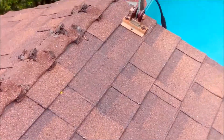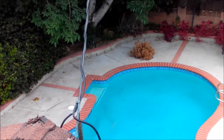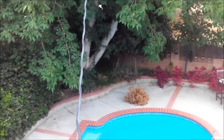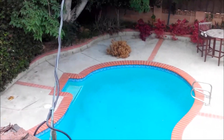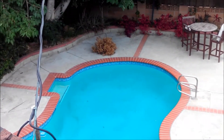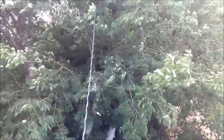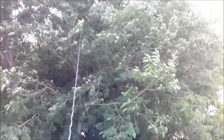At the rear of the house there is a service cable, and it goes right over the pool. It's less than 22 feet off the ground. The service cable also goes through a tree — there are some tree branches on that as well.